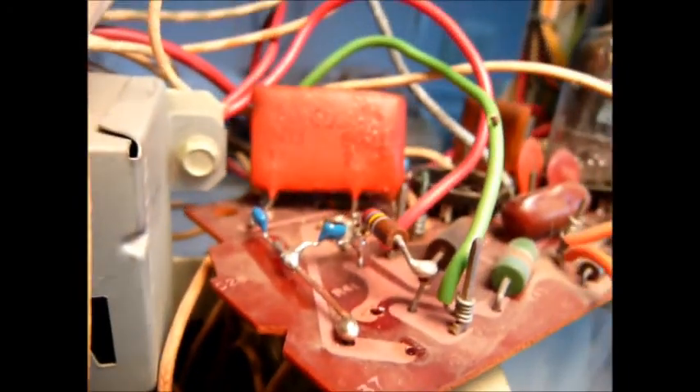They're really delicate, and the 40 watt iron just lifted that right off of there. Normally I use a 25 watt iron for more modern stuff. Usually the solder they used back in these times - like when I was taking the cans off the back of this thing, I just happened to have the 25 watt iron on the bench, and it didn't even get the solder melted.